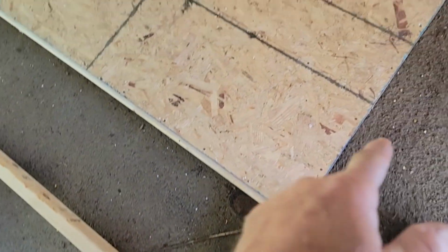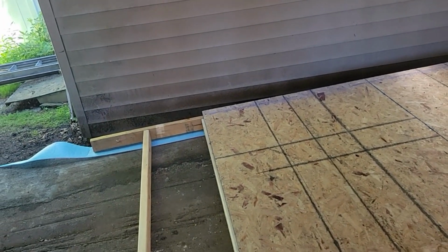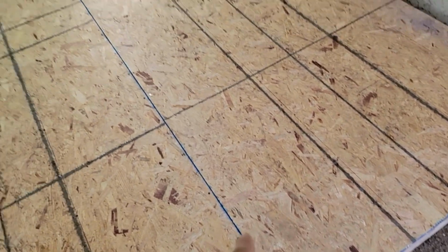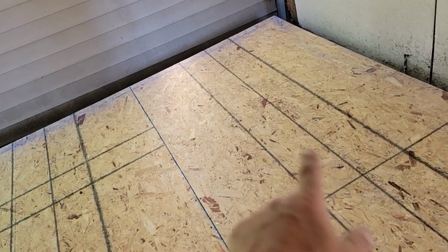All right. We're lining the sheathing up at the top. It's going to hang down almost 2 inches over our concrete. We're 1 inch taper, so we had to rip that on a taper. We line up our top, 16 on center, nail 6 inches perimeter, 8 inches centers.